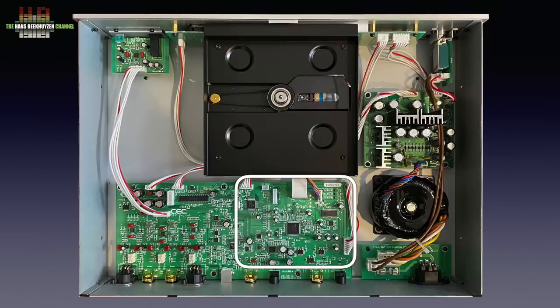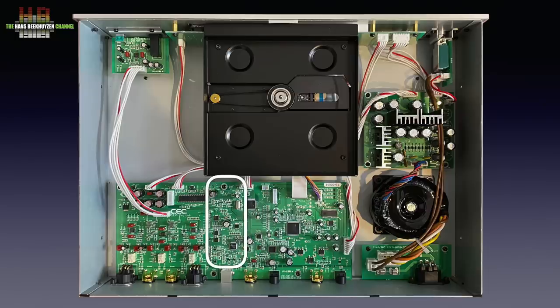The electronics that control the CD mechanism are situated on the circuit board just behind it, with the controller for the laser optics that also handles amplification of the laser output. The transport motor is controlled by a dedicated chip. Most of the digital audio electronics are grouped together here. The ESS ES9018K2M DAC chip is located close to the crystal oscillator. The analog electronics are to the left of it. The output of the ESS DAC chip is symmetrical and remains symmetrical for the balanced outputs, while a separate circuit provides the single-ended outputs. The headphone output is on a separate circuit board mounted against the front of the player.